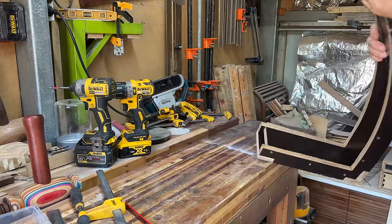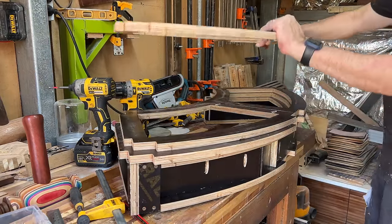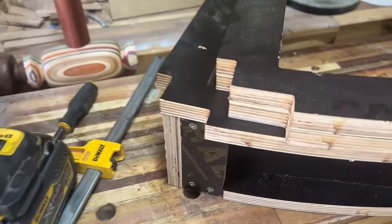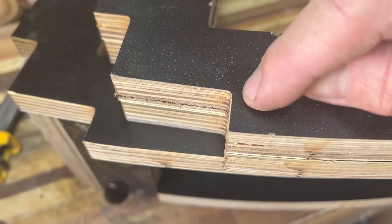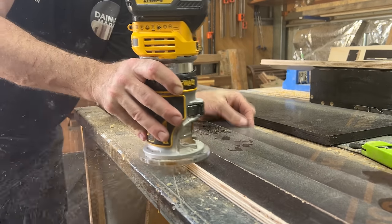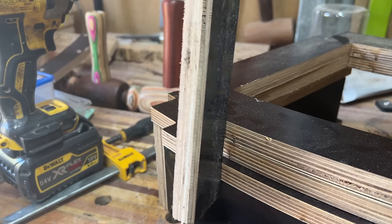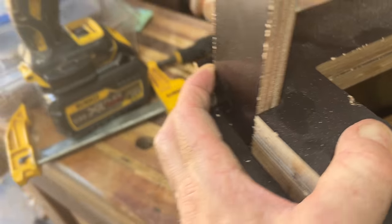With the kickboard sorted, it was really just a simple process of making a skeleton frame to join all the components together. The strength is going to come later in the project. It was pretty cool to have the CNC cut out all the joinery sections as well. However, because of the router bit, all the corners have a round profile at any 90 degree turn. So to save time chiseling all of those out nice and flush and square, I decided to chamferize all the uprights so the rounded corner was not a player and everything sat nice and flush on both sides.